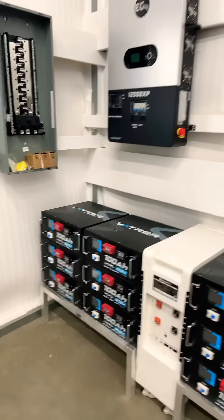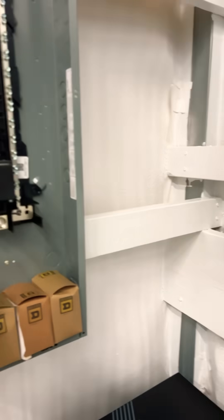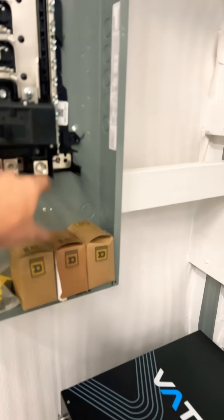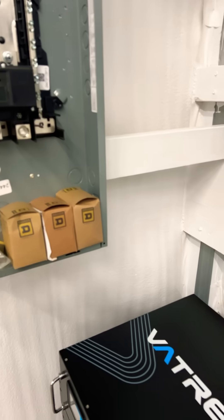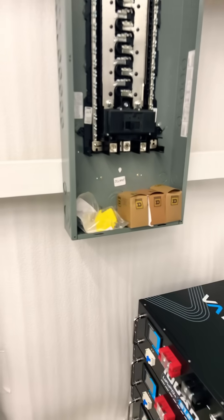So plenty for what I'm trying to do. It's all going to combine together and go into this box here. Three 80-amp breakers will be up there — each one of these will connect into it, and then the output will go to the house, to a transfer switch.